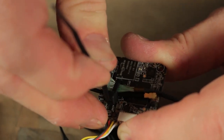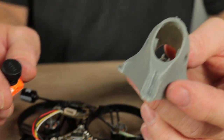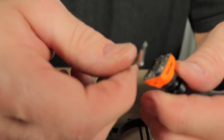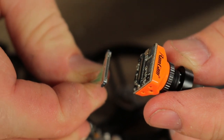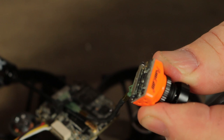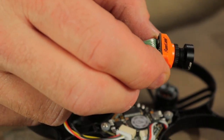It's a very light build. Take some right angle cutters and chop off the end of the zip tie. Next, we're going to mount the camera inside the TPU pod, and then mount the video transmitter inside the TPU pod. Before mounting the camera, get the direction of the camera figured out — put the connector on the camera in the proper orientation; this only fits one direction. You want the camera oriented with the wires facing the sky, and your camera will be facing the proper position in the right direction when you put it in the pod.